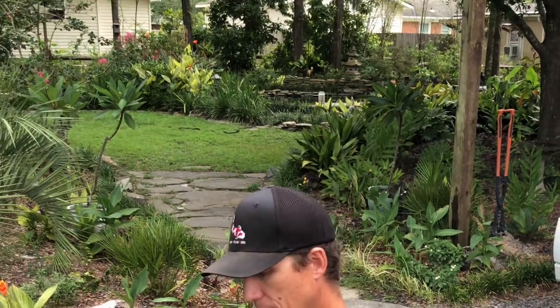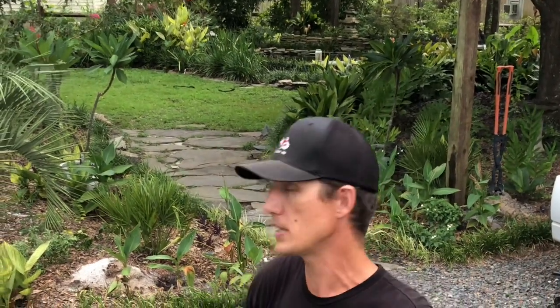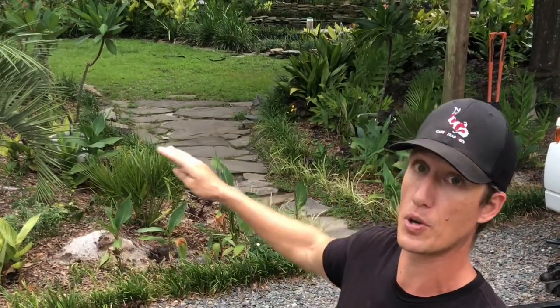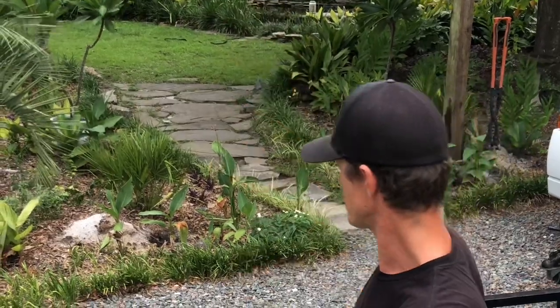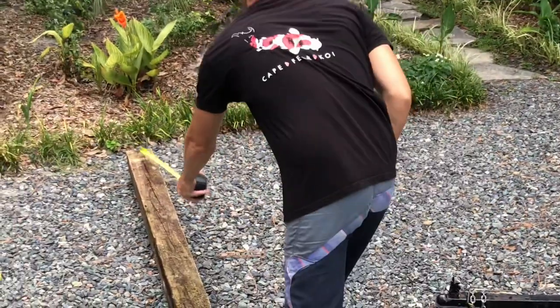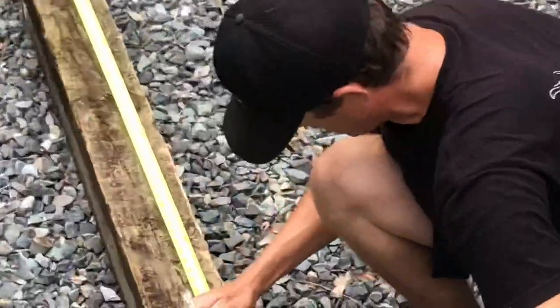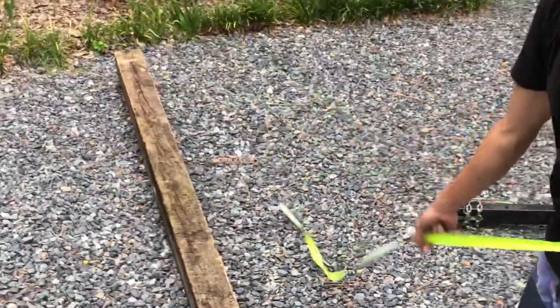I'm gonna mark 8 feet down from the top, set it in my hole, and then I'm gonna take a 2x6 or 2x8 over there, and I'm gonna sit them level on both marks, and that's gonna keep me level, and I'm gonna use those marks to see where I am as far as level goes, and all my tops then will hit just right, and then I can set all my boards up top. Just like that, that's all it is.